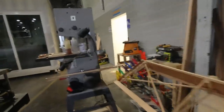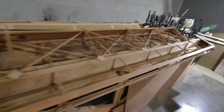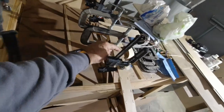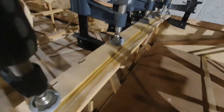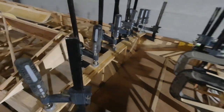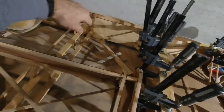So this is getting set up here, and the next step we'll be able to add some eighth of an inch material to the inside of that. Once that's done, we can sheet the leading edge. You saw me put this piece in over here, which goes up underneath this plywood and gets routed out for the tank cover. And here the 3/4 inch piece is already established because the plywood is already there, and this RS17 underneath. So that's good. And then there's a cross piece that goes on here, and then there's a piece that goes across the front. And then there's a brace that braces this tank area that actually goes over here on this side, and so I'll get that as well.